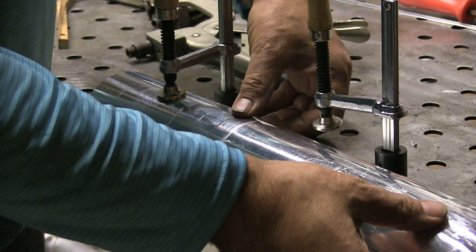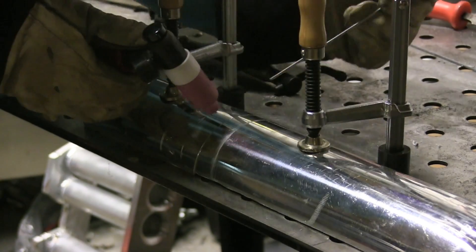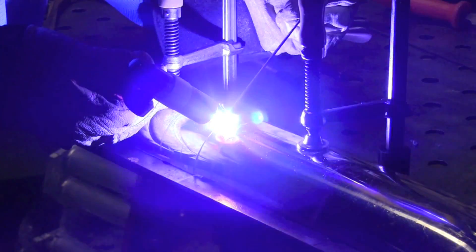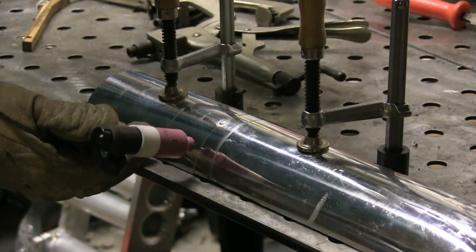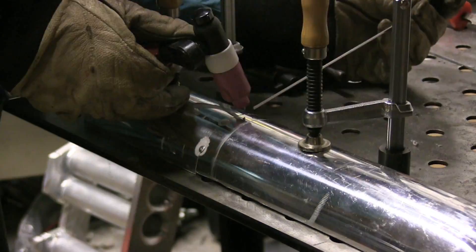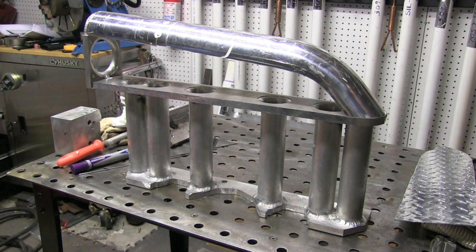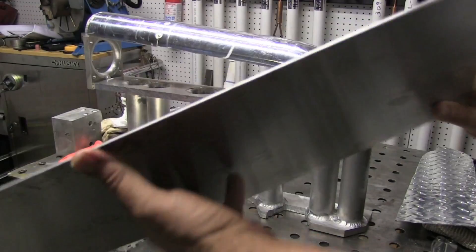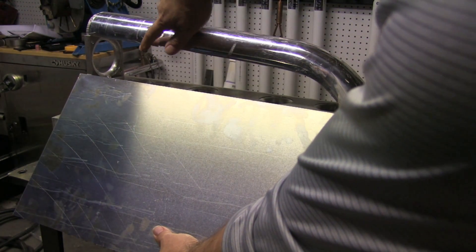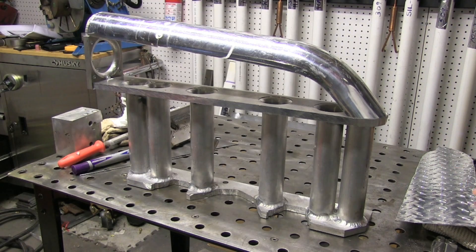Right now I'm going to go ahead and tack weld this little sheet metal split tube for the top of it. I'm just going to clamp it down and get it in a place that matches up — clamp it down against the flat surface. You can see there's some gaps there, so it's not a perfect cut. I'm going to use those clamps alternately to massage it and get the high-low mismatch out of it and get several tacks on it. I had to get it to this point to take it to the guy for a buy-off before going further, and also to get this piece of sheet metal from him.